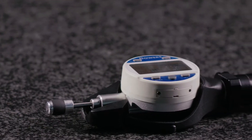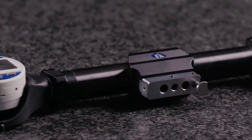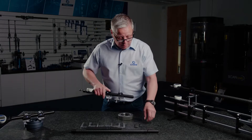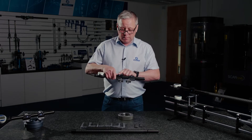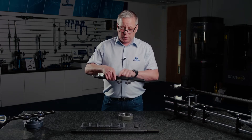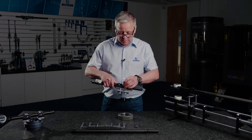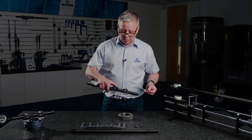This gauge can be set up with various tooling configurations for measuring internal measurements and external measurements. I've got a fixed anvil here in the tooling position and a moving anvil with 20 millimetres of travel, and I can change the spring bias on that moving anvil to change from internal measurements to external.